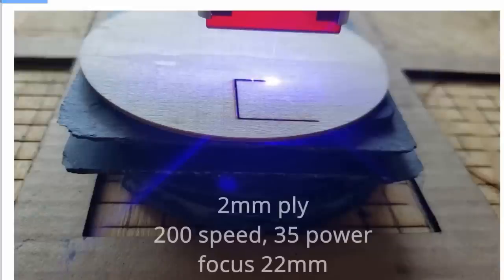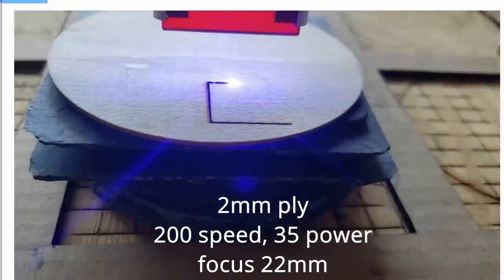This is the important part — the actual beam from this laser. On a typical diode laser, including the Ortur, you have a rectangular beam that's twice as wide in one direction. So when you're cutting horizontally the kerf is twice as wide as when cutting vertically. A lot of you understand this because you'll be trying to cut out a puzzle part or piece of wood and the left and right sides cut all the way through but the top and bottom still haven't burned through. That's the beauty of the NEJE's square beam.